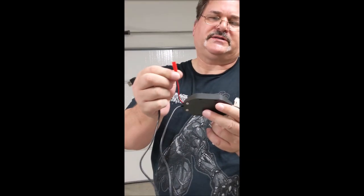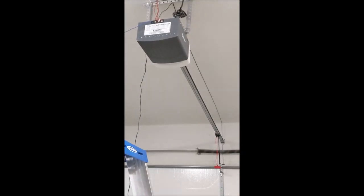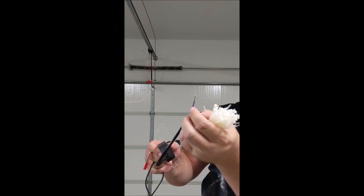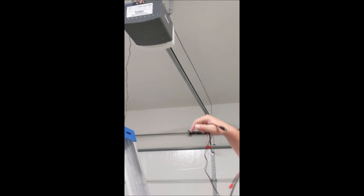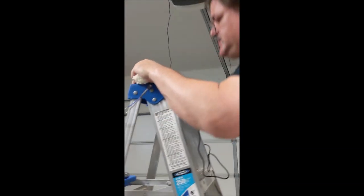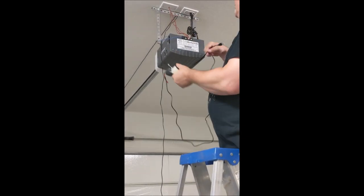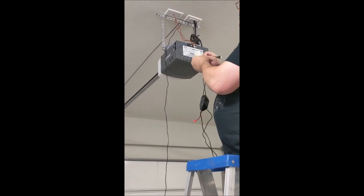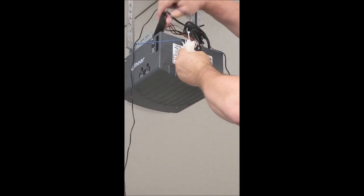First things first — this is going to be for your power, and this is to plug that sensor in here. So we're going to have those facing up to go to the sensor and the outlet up top. Then the bottom part here with the two wires — this connects into the garage door. So we want this pointing down to run these lines to the garage door. The shortest cable on here is going to be these two, so we've got to make sure these are going to be able to reach. I'm going to go ahead and connect these two up, and then we can figure out where we want to place this unit.